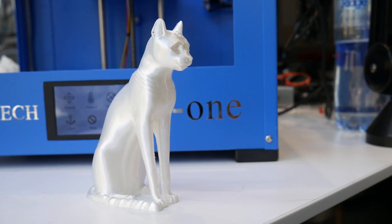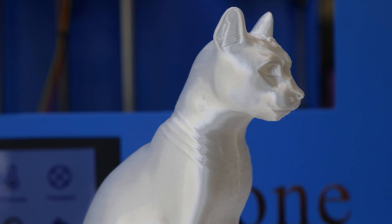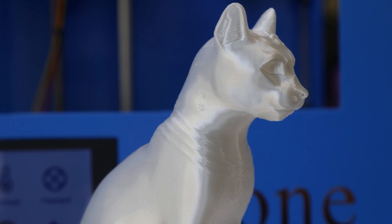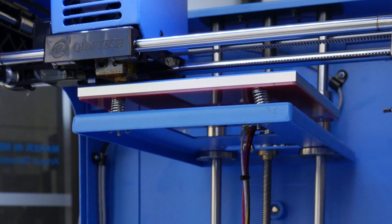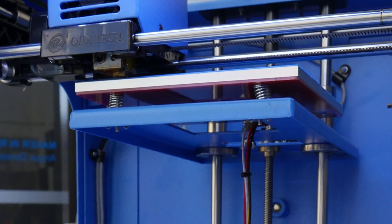And then I printed my favorite cat model — once again, flawless layer accuracy and a really nice result. I think the key here with the GD Tech X1 is the bed doesn't move. It just drops down layer by layer, and it's really rigid because of the sheet metal design, so it doesn't flop around when you're doing fast infills. I also think the smaller bed size and therefore smaller mass has something to do with it as well. It is a small machine, and it is over-engineered with sheet metal, so it is very rigid during printing.